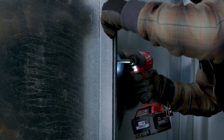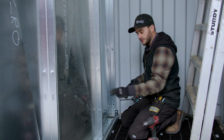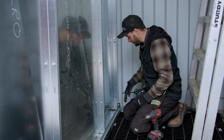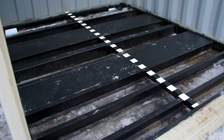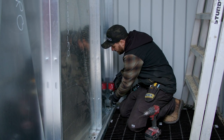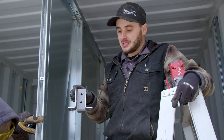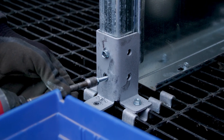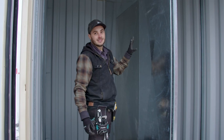We've got the rest of the partition wall all bolted together to the roof strut and down the sides. Just the floor is a little floppy yet. We're using the last chunk of strut as a straight edge all the way down to get this nice and straight. We've already prepared and have that angle iron welded down the seam, so now we just put in long self-tapping screws and make sure we hit that angle iron. Here's our base bracket — down at the bottom, it should hug the strut nicely and give us three places to screw down into the floor of the shipping container.